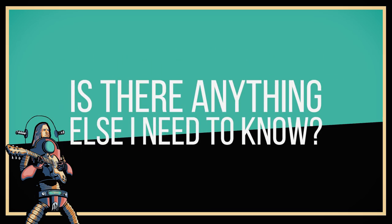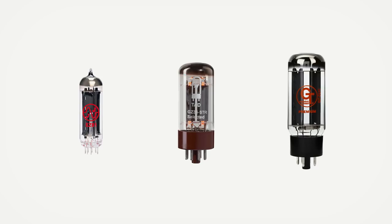Better doesn't always sound better — except when it does. It's kind of a stylistic preference. As with almost everything in this industry, there are far more complexities and player preferences than previously described. Even within the world of valve rectification, debate rages about which valve rectifiers are the best. There are many different shapes and sizes of glass bulbs designed for rectification, but which one is best really comes down to the design of your amplifier. Rectifier valves differ in their pin layout and physical size, but also in how much power they can handle, how fast they can respond, how much sag they exhibit, and what power valves they're going to be paired with.